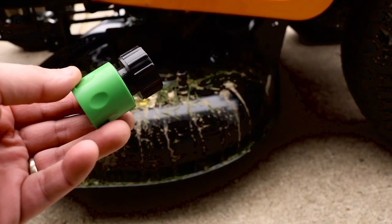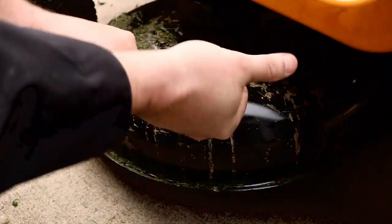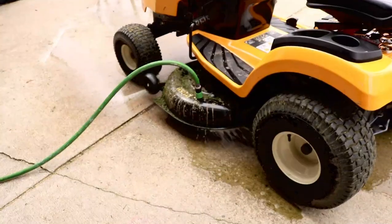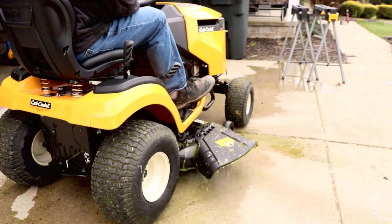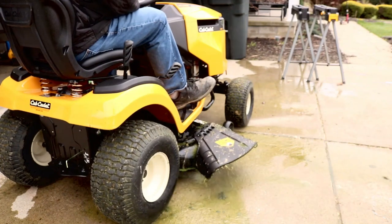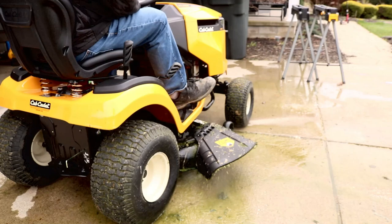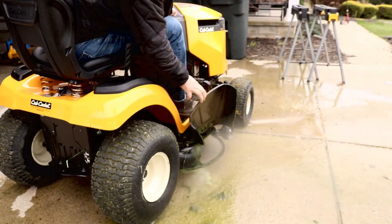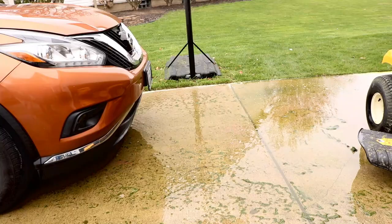They give you this little attachment — you throw it on the mill on your mower deck and hook up your hose right to it. Screw it on your hose and attach it to your deck. Super simple. Turn on your water and then engage your mower blades. You can see all that nasty, muddy grass underneath there — instead of getting all balled up under the deck, it just blows it all out. Run that for about five minutes and you'll be completely clean underneath. There's a lot of airflow coming out of that thing.